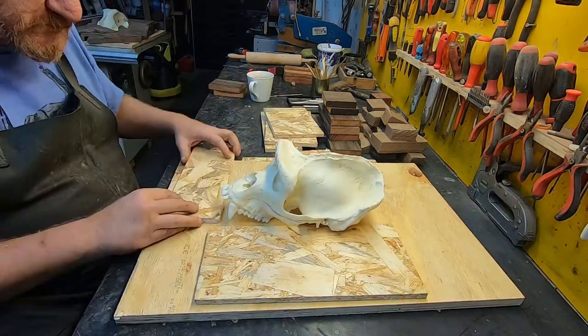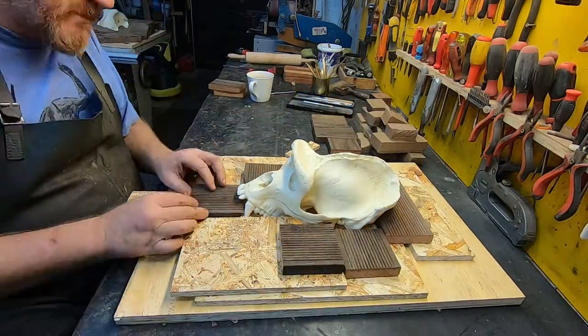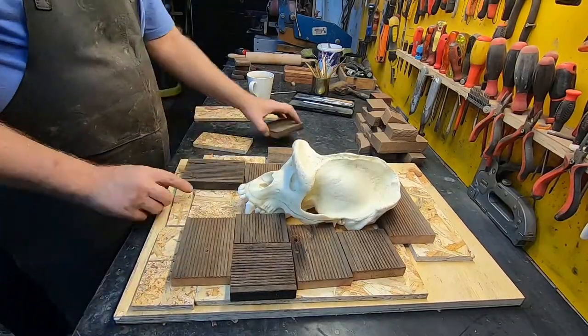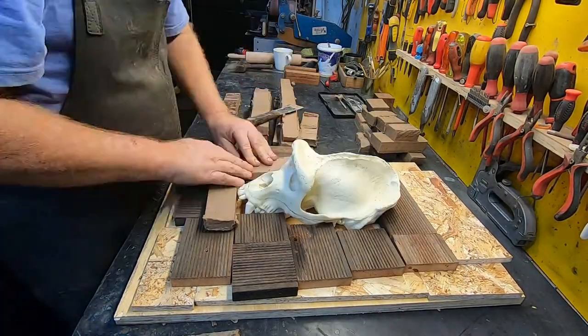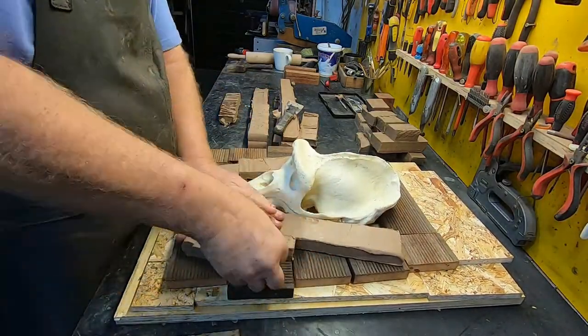To use less clay, pack some of your offcuts around the object till it is close to the line you just drew. By using wood, it will later be easier to remove the clay again. Now start to pack clay all around the object and stay below the pencil line. We call this the clay bed.